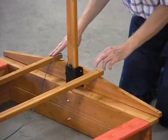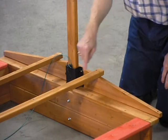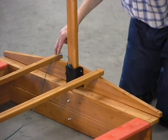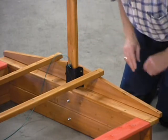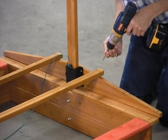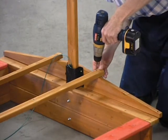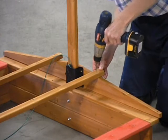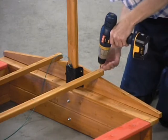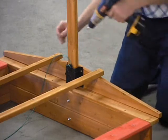And what you want to do is line those up on both sides. Once you have lined up your roof supports and made sure that all the holes in the lateral supports are sitting centered over the triangular roof support, then you can go ahead and attach those lateral supports on top of the triangulars. I'm putting 1 long screw down to the hole and 1 of the little shorter screws. So on each end I use 1 long, 1 short one. And go all the way around when you do that.